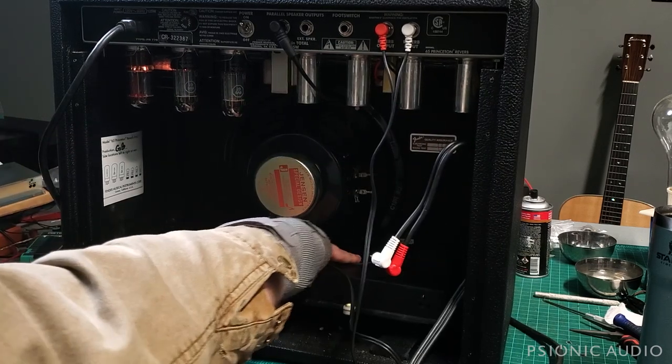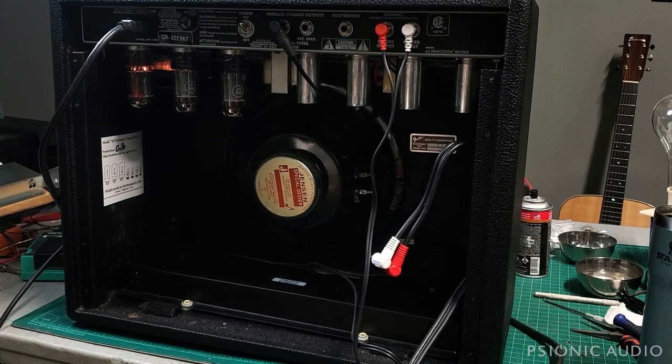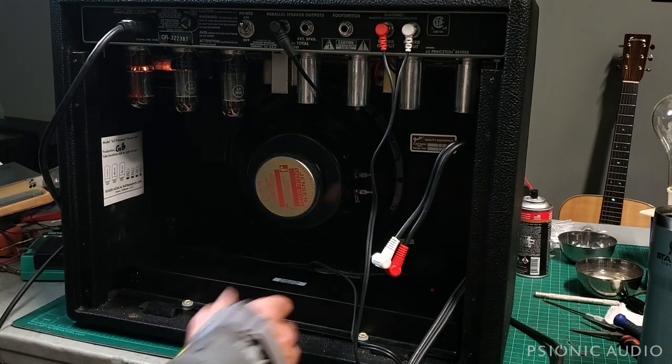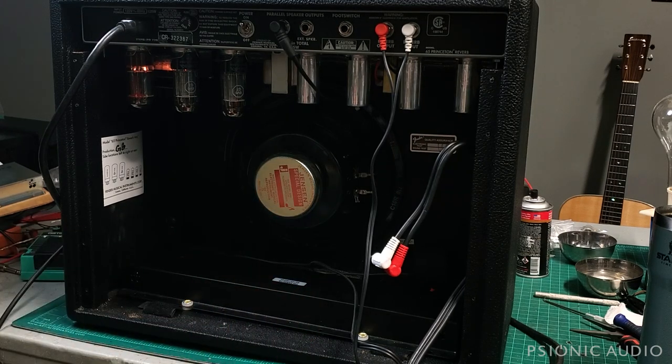So there's a free tip for you — a very dramatic sounding free tip — with Fender amps: make sure that the reverb tank connections are facing the speaker, not facing the rear. And make sure your tank isn't the source of a bunch of hum and buzz.